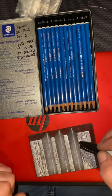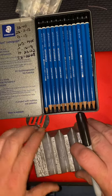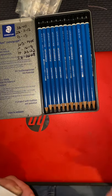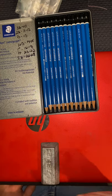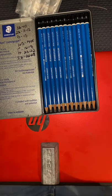Once you get a scratch in there, whichever pencil was the last one that didn't leave a scratch — that's what the hardness is. The video I saw a long time ago explained it really simply and plainly, and that's exactly how I explain it: you go until it scratches, and the pencil before that is the hardness. That's it. You don't need to make any custom points or do anything — that stuff on the forums was just a snipe hunt, pretty much.